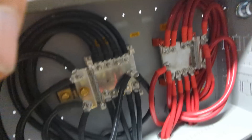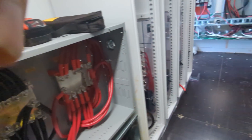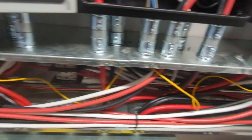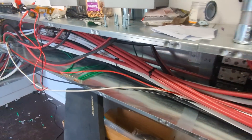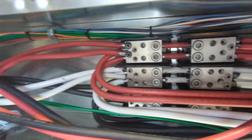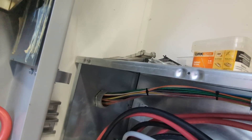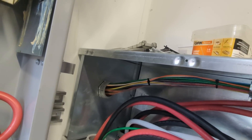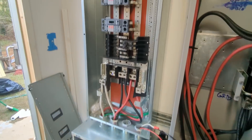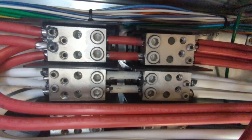I'm showing you all the goodies before we close up these wiring troughs. This is the 2000-amp combiners from Midnight, plus an extra cable management gutter to keep the loops out of the AC gutter — trying to clean things up. There's a loaded-up power distribution block times two. The solar comes pre-wired for 168 modules that will be connected to the outside through the power distribution blocks. The reason we're even doing this is that the person who watched the YouTube channel saw the PDBs and thought they were the coolest thing ever — so those PDBs got us this job.